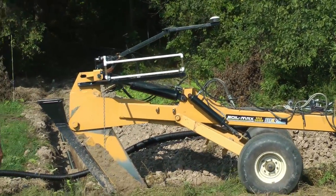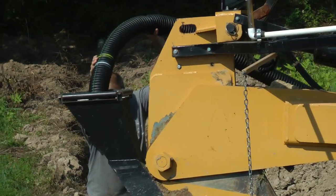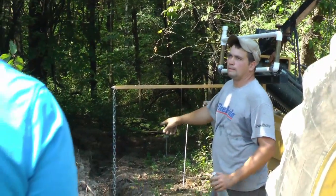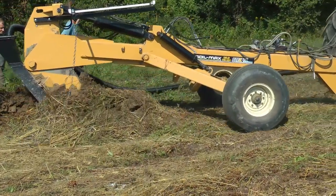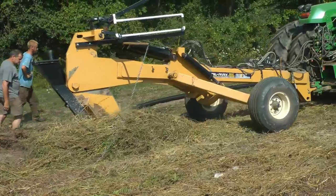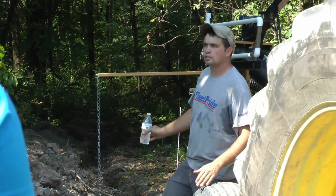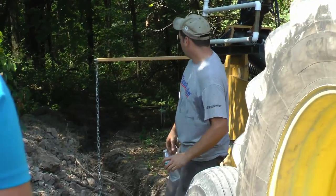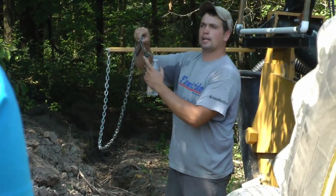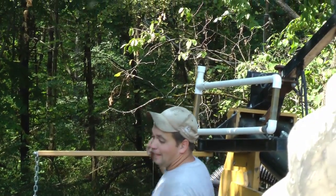You still have to steer a little bit, but as far as controlling the actual pitch of the plow, I'm not doing any of that. Basically you're making sure you're following the same path, keeping an eye on your water level and depth change. Signal interference is rare — I've had it happen only twice with the base station we're running now, typically if you're really tight against a hedgerow and lose signal. For reference, you have your depth chain with markers — I use an old ear tag at the three-foot mark. If there's more water in the back and more water in the front, that means it's golden.